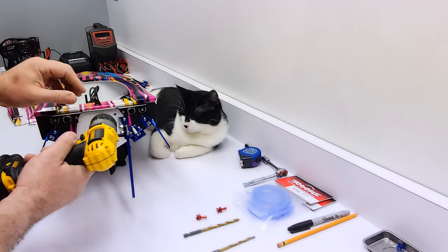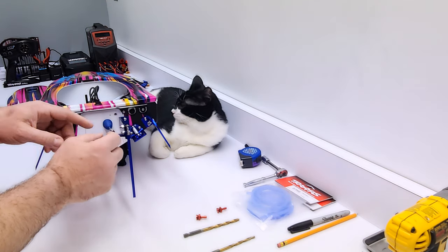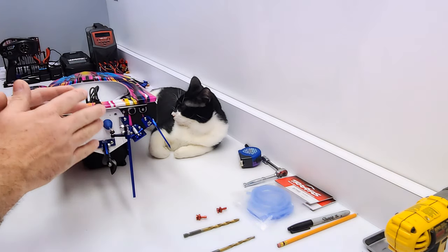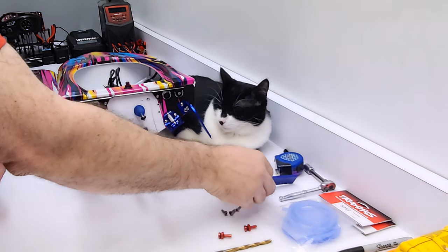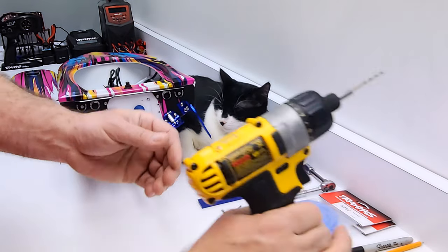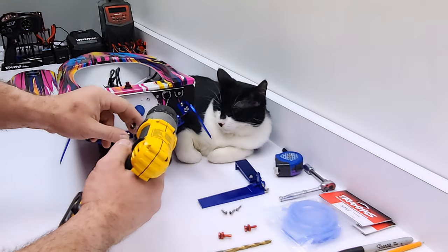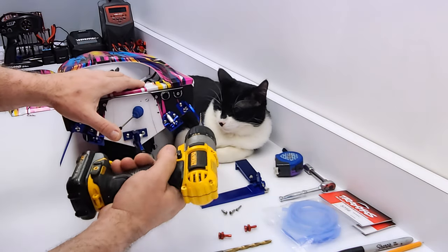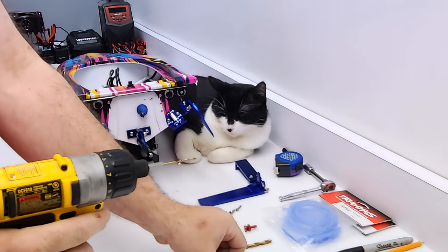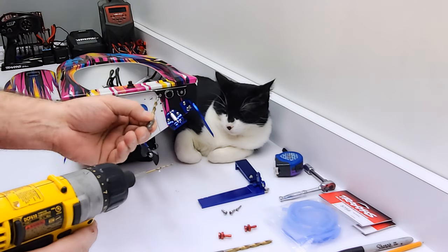When I went to go drill my pilot hole, I noticed that this mechanism here is in the way. So off camera I'm going to go ahead and disassemble the linkage here, move this over and see if I have room. I went ahead and removed this piece to give me room for my drill bit because my chuck was in the way. I also removed this shaft from the servo horn from the inside of the boat — three screws total, not a big deal. The reason why you want to use a pilot hole is because when you go to a bigger bit, you do not want to have your drill bit walking. The pilot hole helps guide the bigger bit so it doesn't walk.